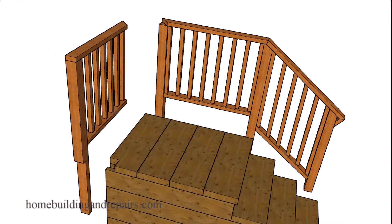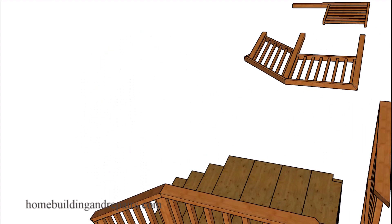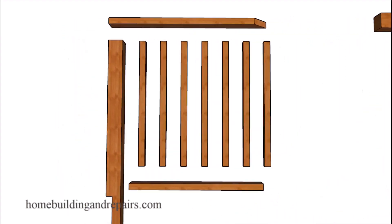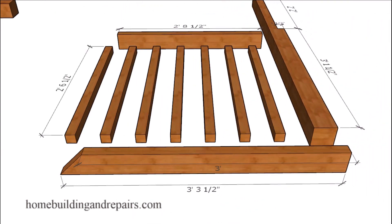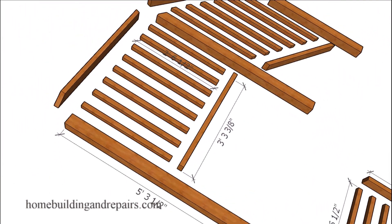Let's take a closer look at the hand railing. We're extending this board three and a half inches out so that the three posts can sit on top of them and securely fasten to them. Let's take a look at the handrails in pieces to provide you with some measurements. Keep in mind that if you're off just a little bit on some of these measurements, or if your lumber is a little bit thicker or thinner, then some of these measurements might not work out as well.